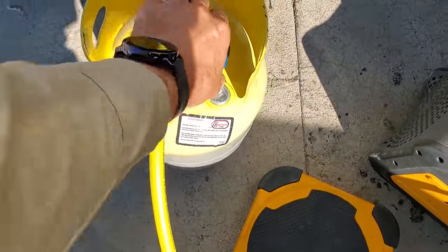It's not full of oil or anything, but this is just full of junk. Really bad. So that's why I went ahead and changed the TXV too. I'm going to open up the TXV because I looked in it and there was some goo in there. All right, I disassembled the TXV, but look, there's a sludge in there, some kind of sticky goo. And if you look at the spring, it's also got the sticky goo on it. It's nasty, sludge-like. Look at the pin, same thing.